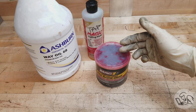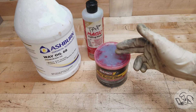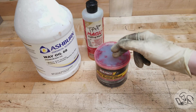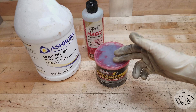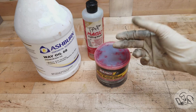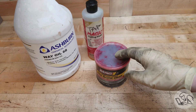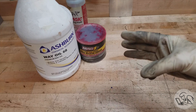The question of whether to use grease or oil is always interesting. The rule of thumb is grease is good for harder-to-access areas because it stays in place longer, but grease collects chips — so if the part is exposed to swarf, grit, or chips, don't use grease. Oil has to be replenished but doesn't collect debris. For my change gears I prefer grease since they're inside a cabinet away from swarf. For lubricating chuck mechanisms I prefer way oil since that's exposed to chips. If in doubt, lean toward oil — if something is intended for grease, it needs to be designed for it with looser tolerances.